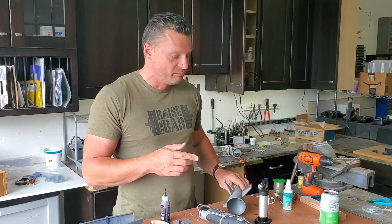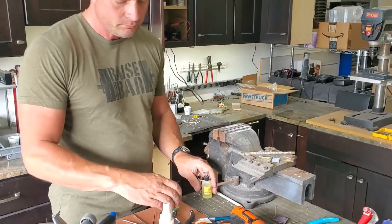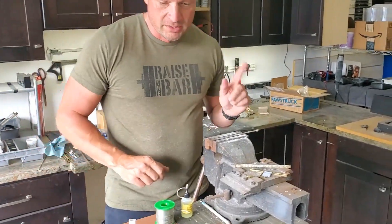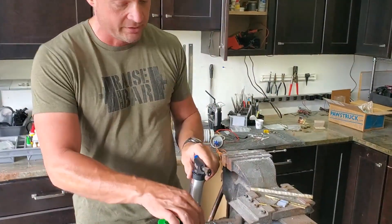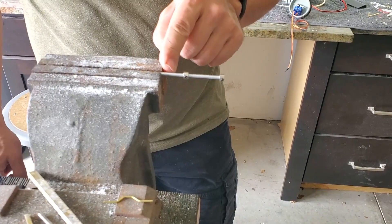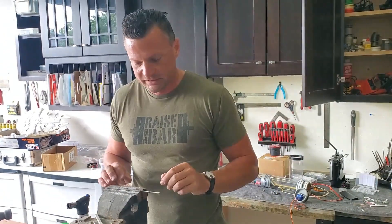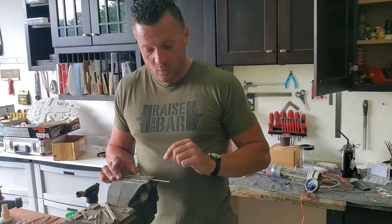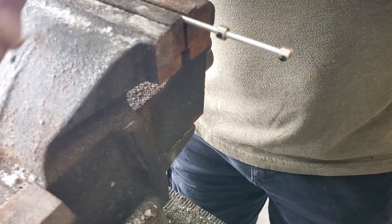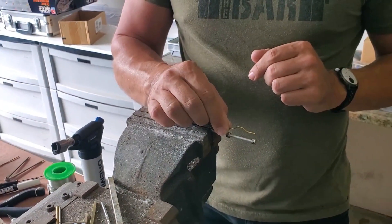I'm going to show you how to build your own yoke. You'll need some soldering supplies — silver solder and liquid flux. You'll need a propane torch; I've got a small torch here. A piece of aluminum tubing — it's important that this is aluminum when we solder, because then the solder won't stick to it. If you use brass, you'll solder everything to it and it'll all be one piece, which would be terrible. You'll also need two 1/8-inch plated wheel collars, and I've got them situated on there right now. I've also bent the connecting piece of brass rod that's going to sit on top.